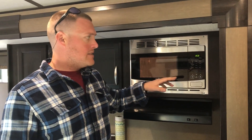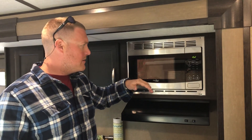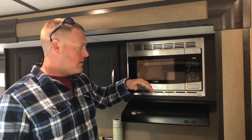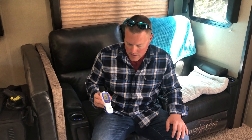I just took it off eco mode and put it on turbo so it's running full out when we try to engage this. We'll hit two minutes. It's struggling to keep up, not running full out right now. You'll see on the voltage meter and amperage that it's a slow buildup — that's the dimming you're seeing on the microwave. Once it finally levels out at about 11.5 amps, that's when we're running. Running wide open 100%. 45 decibels inside.